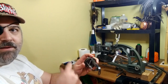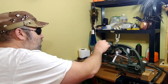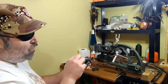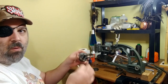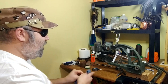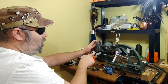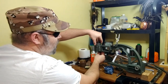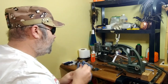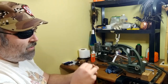To get this together, I like to flip it upside down so the presser foot looks like this. Take the upper part of the sewing head and use my index finger to push up on the spring so we can slide these two underneath, and bring that until the spring goes into the little cutout. With a little bit of tension and holding things into place with your index finger, we will drop it into the sewing head.